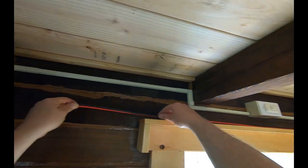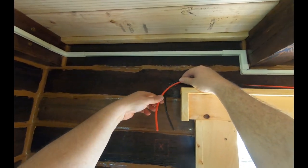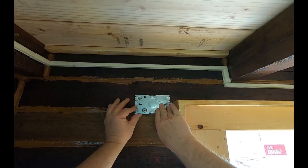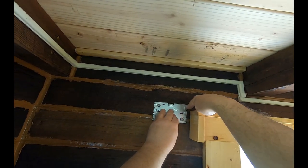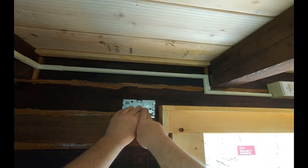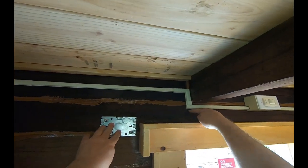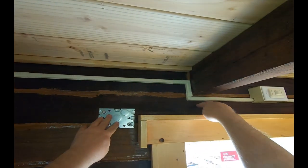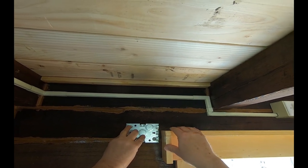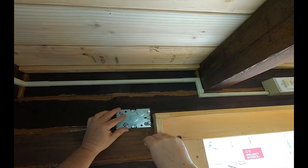It looks like I don't have a ton of wire here, but that's okay - I can put my outlet up here. It doesn't matter if it's down here or up there, so I'm just going to put it right up here. I think I'm going to put the box right here so my channel can run right on top of that shelf, and then I just have to put my channel across. That's the easiest way to do it and it leaves me some room up here to run my last piece of channel. Everything's tight fitting up here - I didn't want to drill through these and don't want anything too tight against this.